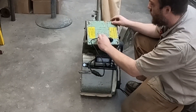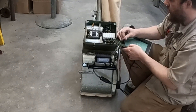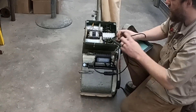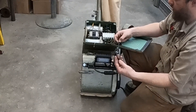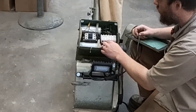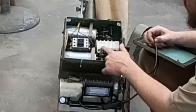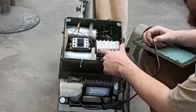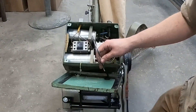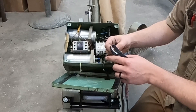Feed your wire through here. Now we need to cut the insulation off part of this so that we can split our wires off to connect. Our two hots will connect on here and the lower terminal here — they're right next to the R and N. Those are our two main power lines coming in. So when we connect this, this light will be on as long as the machine is plugged in. Once you have that insulation stripped away, strip the ends of these wires and crimp on the ends that we're going to be needing.